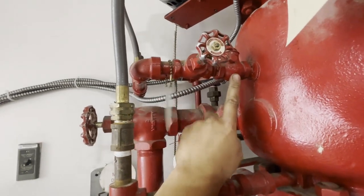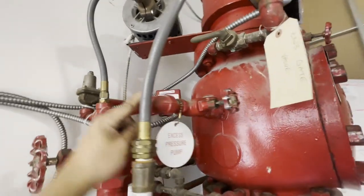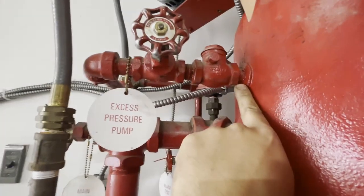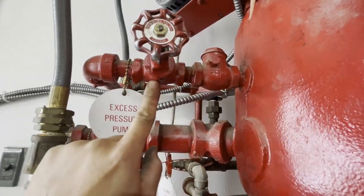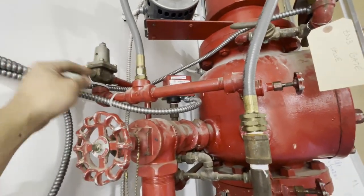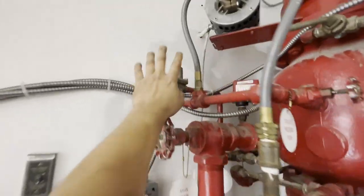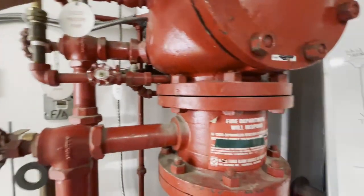If the customer decides they want to replace it, what I would probably do is get my sawzall, cut right in the middle, back that out. With the system drained, take the valve off and check valve off. Rather than have them over a close nipple right there, I'd bring it out a little bit, put my ball valve here, put my composition globe valve, check valve, come back with a 90 and tie in with a six-inch nipple over a half-inch union right there — so I don't have to deal with it. Right now my easiest option is to disconnect that union. That's my explanation of why I don't really like these things the way they are, but it is a very common installation.